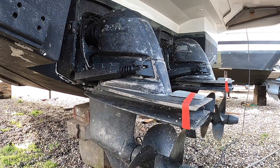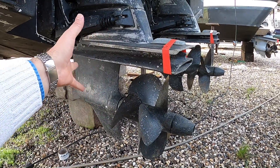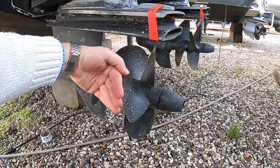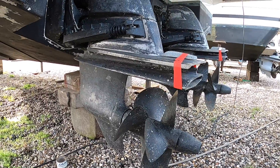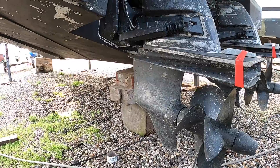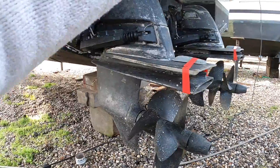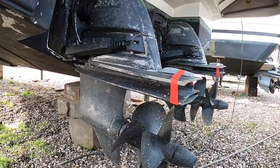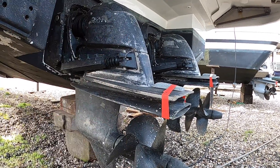There are a couple more advantages to mention. The handling of these is very good because when you steer the boat this whole unit turns, and not only does it act as a rudder but the actual thrust — you can imagine as this turns — is now pushing the boat about. So in a sports boat you get much faster handling. Also if you're going along at 30 knots and you hit a plank of wood in the water, these are designed to tilt up out of the way and then come back down again, which is quite useful.